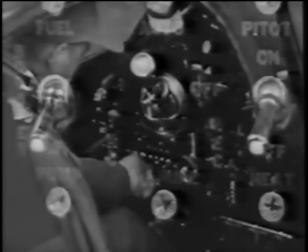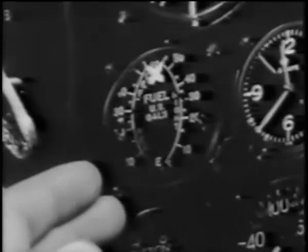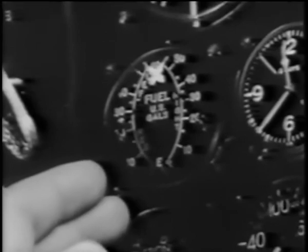When you turned on the battery, it energized the fuel transmitter. Remember always to check the fuel in your tanks. Down on your left is a fuel selector valve, which makes it possible to draw fuel from four lines, three actual tanks. For takeoff and landing, always use the reserve tank, which is part of the left wing tank.